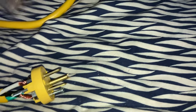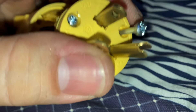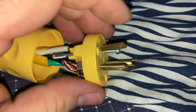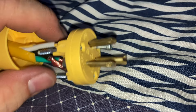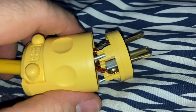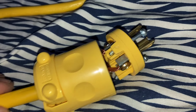I went ahead and cut this piece off and added our new male plug — it's pretty much self-explanatory. There are three prongs here: the bottom one is going to be ground, and then you do your black or white on the other sides. We're just going to put this up in here with the three screw holes. And we're going to use these two to tighten down the plug so it's stationary and doesn't move.